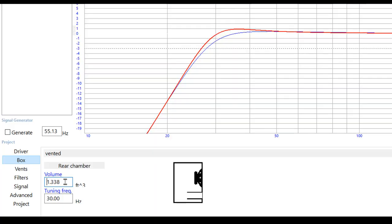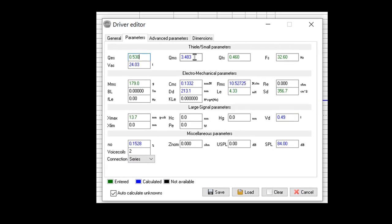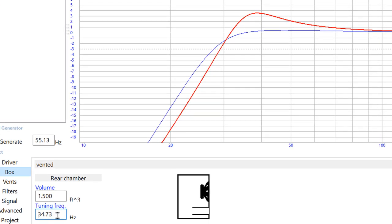Before any of that, I've got to design the enclosure. I like to use WinISD — it's a free program you can download from their website, link in the description. After you enter the T/S parameters, it's just a matter of adjusting the port tuning and enclosure size until you get the sound you want. Tune it low for home theater, a little higher for car audio. You'll also want to check port air velocity to avoid chuffing and check cone excursion to make sure you're not exceeding Xmax.